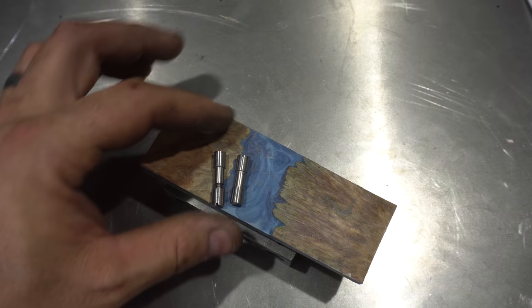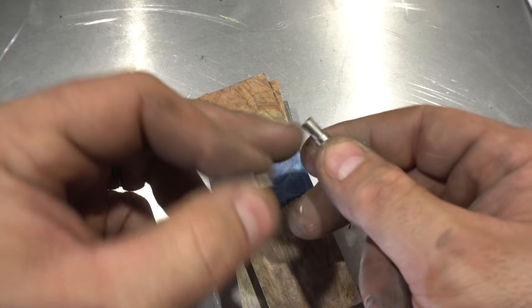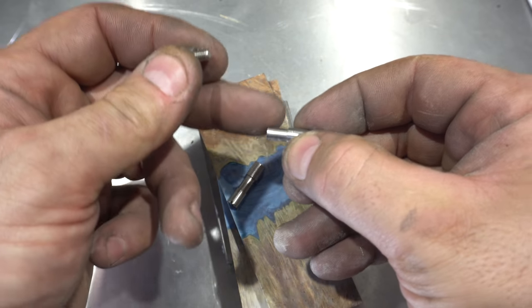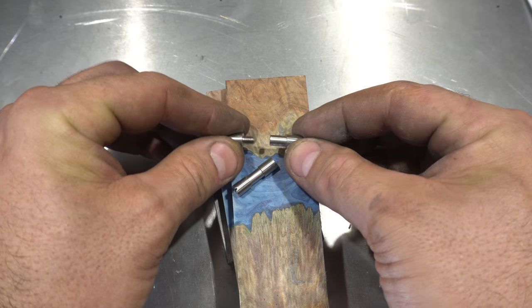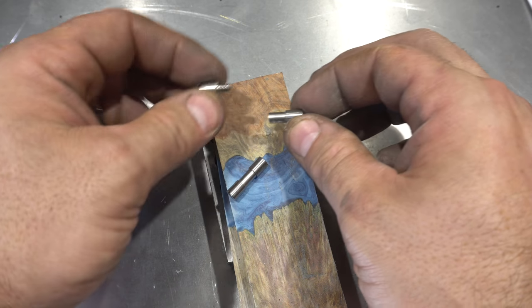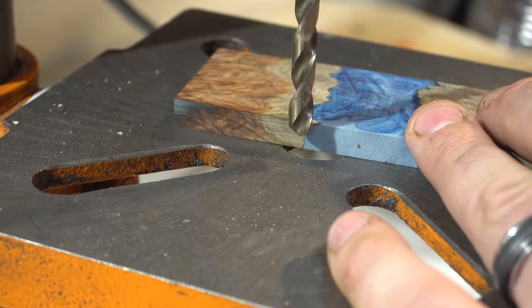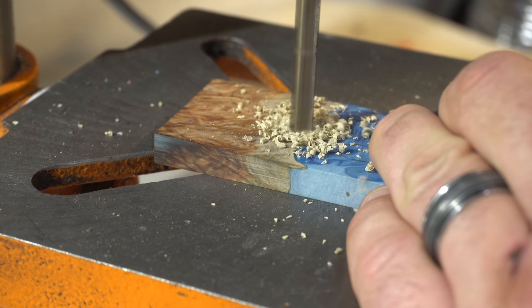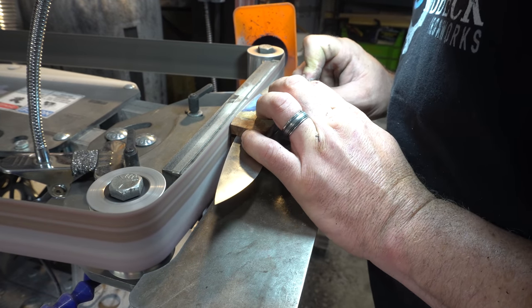I should mention a bit about these Corbys. These need to be recessed — you'll notice there's a little shelf here. So you drill the center hole. These are 3/16ths with a quarter inch outer. I'm going to drill through 3/16ths and then drill approximately halfway through the scale over the same hole with a quarter inch bit, and that should make these stop and pull the scales in. Because I've still got the Corby bolts in here, I'm using a 1-2-3 block just so I can grind the edges without the Corbys interfering.